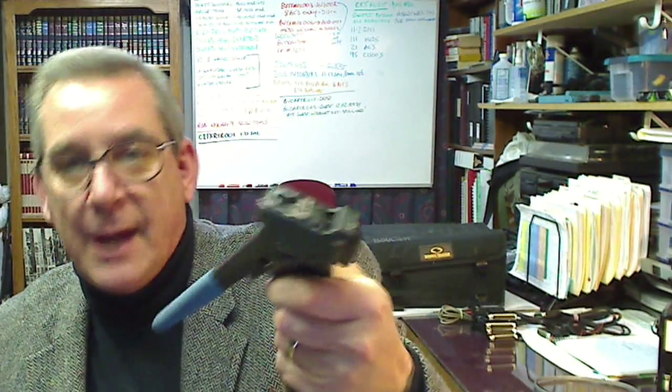I've got flat stranded. Now this is what you would use for the silver satin eight-wire cable. It says 'flat stranded.' The crimps are different. It's square inside to accommodate the flat cable. And for stranded, you can see it's only two little crimps — it splays out the stranded wire when you crimp into it with the crimp tool.